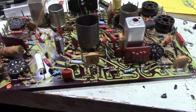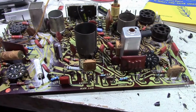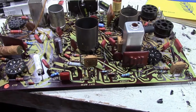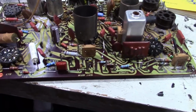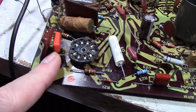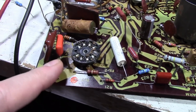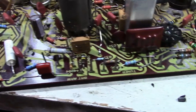I also want to point out some other things. There are some oddball component values. So if you're thinking of trying to do the same thing in shotgun, all the parts, just beware. I've mentioned previously that this capacitor is a .0015, needs to be rated for 1,000 volts or better. And some of the resistors are a little bit odd.